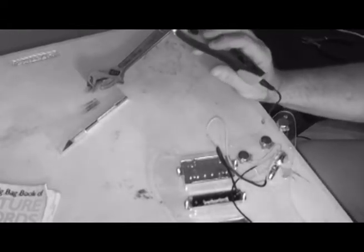Now, I gotta show you something on this diagram. See, I'm the guy who always asks why. And in this case, I got a big one. Why does all this stuff have to solder to the case, after we bend one of these lugs back and solder it to the case? I get why we're grounding the case so we don't get buzz if we touch the bare knob without some kind of a cover over it. Likewise for the other two.